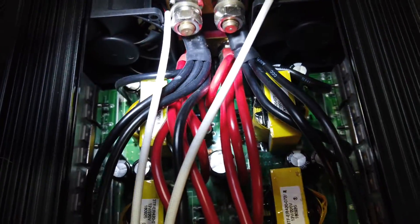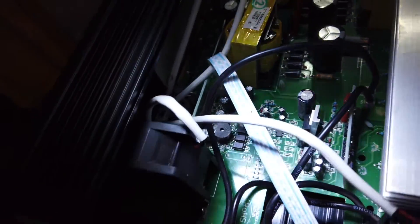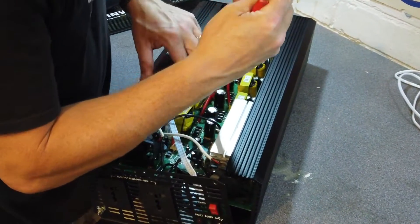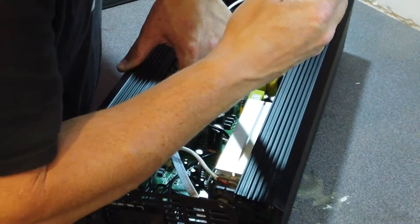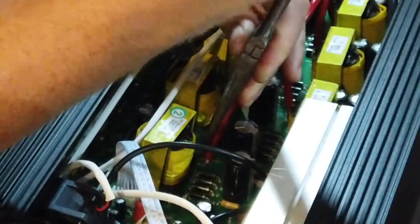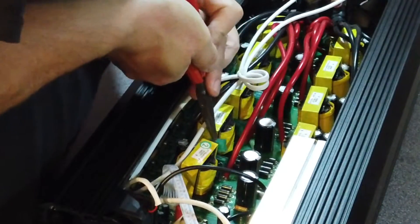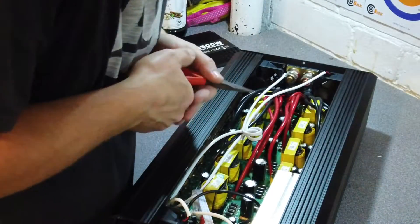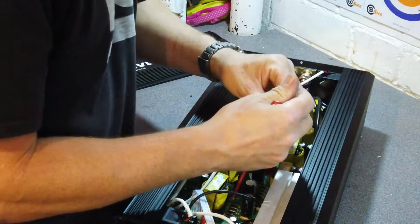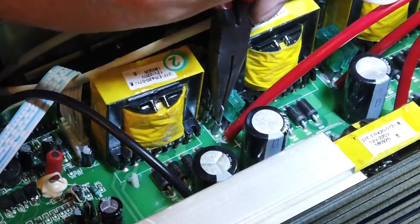I can't see anything clearly enough — let's change all of these fuses out, put some voltage to it and see what it does. I've got the long-nose pliers — let's grab hold of one of these. Wow, they're a bit stiff in the holes. Maybe I need to go with a smaller pair, a bit more delicate. Oh — it's actually come to pieces! That's not good; it must have got really hot. Here's the fuse — it's absolutely blown.